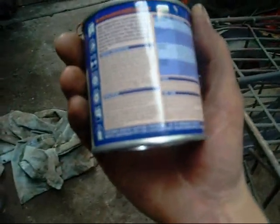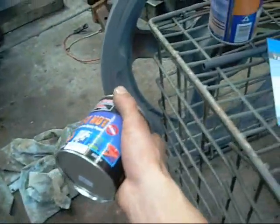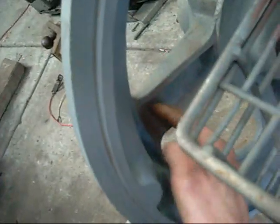Then I'm just going to coat the whole lot in lacquer — I'm using a polyurethane-type lacquer. I think somebody suggested polyurethane, so that should do it. White high-chem paint for the inside — it's an epoxy enamel designed to go with this high-chem spray primer. And I definitely need to look at getting that crack fixed. I was thinking of milling it flat at work — mill it out square and then bolt a strap in there just to keep it together.